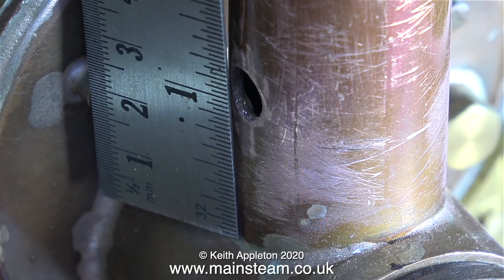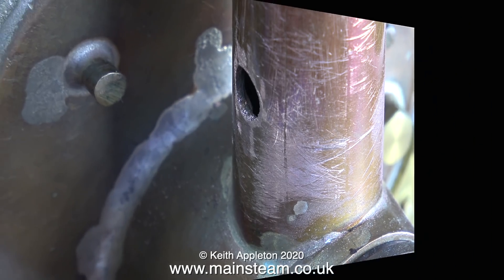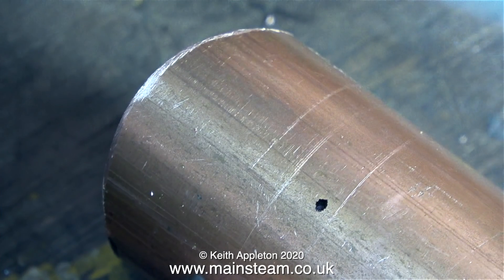The story so far: the outer tube fits on the inner tube. Now I need to drill a hole in the outer tube in exactly the same place as the one on the inner tube. It's simple enough to do. I've taken a measurement from the center of the hole in the existing chimney down to the point at which it meets the flue tube, and I've made a spot on the outer tube using a felt tip pen where I need to drill the hole.